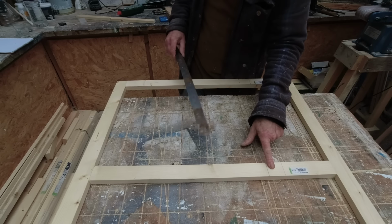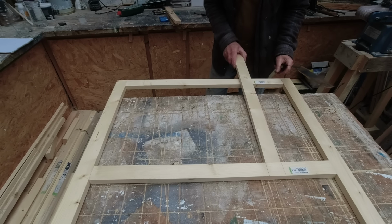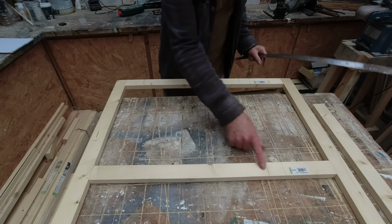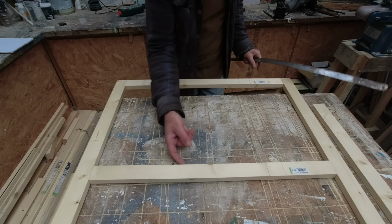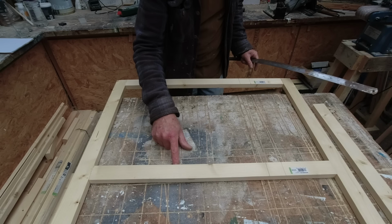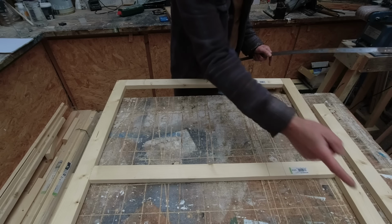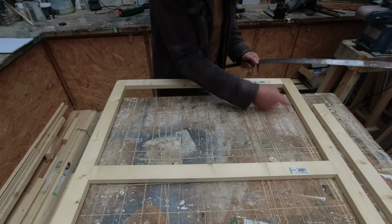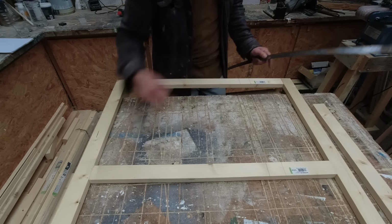Alright, so I've marked out for the drawer there, and I've also put in the width of the batten, which will be going in there. And now what I want to do is find the centre of this here. We're going to put a catch here on the door in the centre, and we're best routering that out before we put this cabinet together. We'll also want catches on the top here where the drawers are going. So I'm going to mark all of them out, and then I'm going to router them. Just much easier to do before we put this whole thing together.